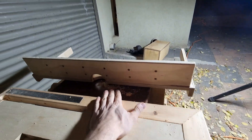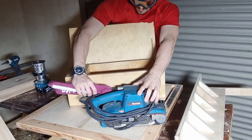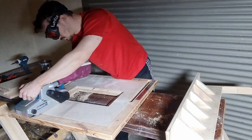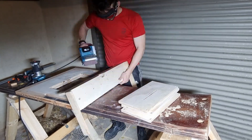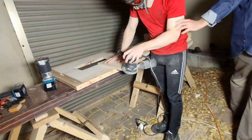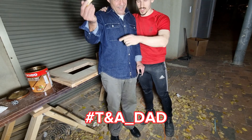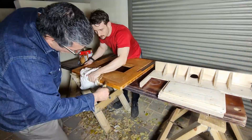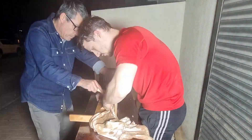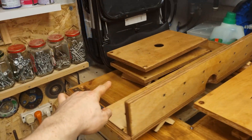Looking amazing — same with the fence, now let the sanding begin. I started off with the belt sander. First came 120 grit sandpaper — because most of the parts were already sanded and it's plywood, it comes pretty smooth when you buy it. Then came 180 and 240 grit sandpaper with the orbital sander, because the sides and small nooks and crannies can't be sanded with the belt sander. I wiped off all the dust and now we're going to add some finish. I used some old finish and it came out super dark but it ended up looking great. I've spaced everything apart so it has a lot of surface area to dry.